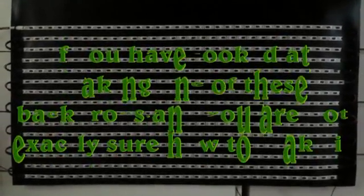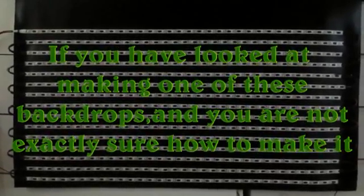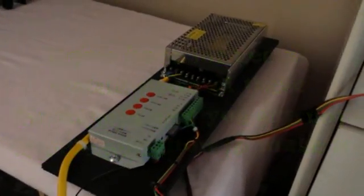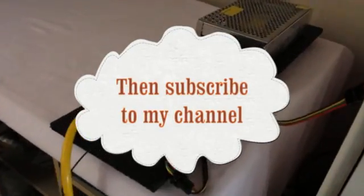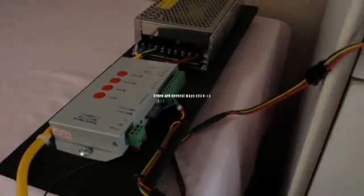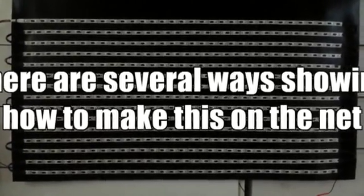You can see my LED display. I've actually mounted all of the LED strips onto a strong piece of rubber matting. The LED strips are WS2801 programmable LEDs, and the whole thing is controlled by the power supply and the T1000S programmer, which I've mounted onto a board with snap-fit connections so it easily comes apart. The screen size is 33 pixels horizontal by 15 vertical.